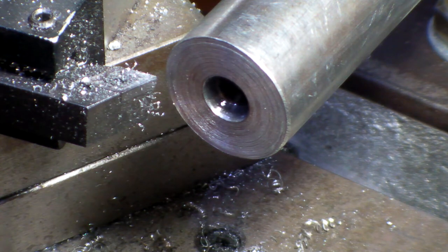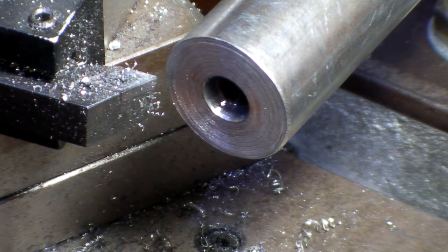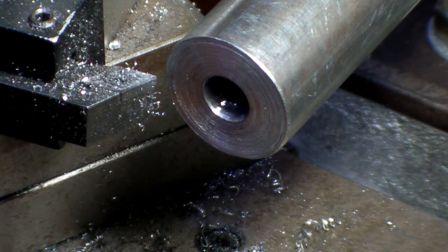So just say we're putting a quarter inch end mill in, we'd have to make up annular spacers from the quarter to 5/8". I've decided not to go that way, mainly because collet chucks are so cheap these days. So I'm going to fit this with an ER32 MT2 collet chuck. This will have to be bored out to an MT2 taper when it's on the milling machine.